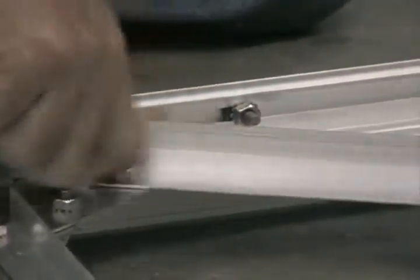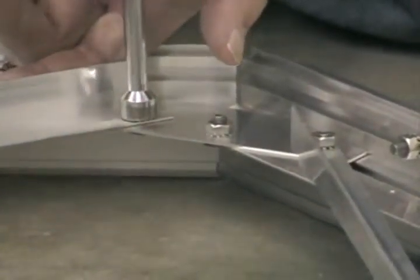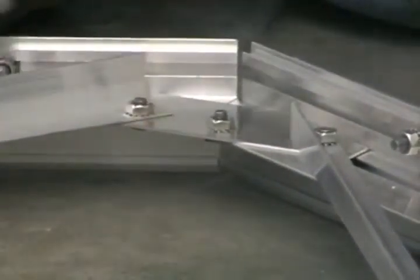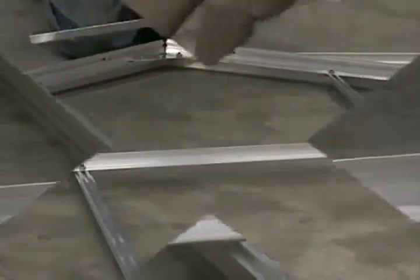Okay, to do this, we'll go ahead and relocate and line up the cross brace across the frame onto the T-bolts. Secure at the moment. Cross brace positioned all the way across and bolted down into place. Note it is positioned on the two leg brackets on the corners. Also, we have it bolted across to each of the glazing bars across the centre on the back. Also note, we still have the two remaining T-bolts in the slots above the bracket.